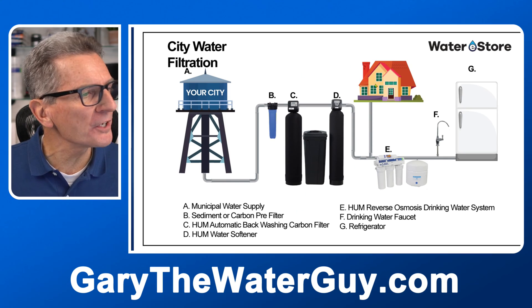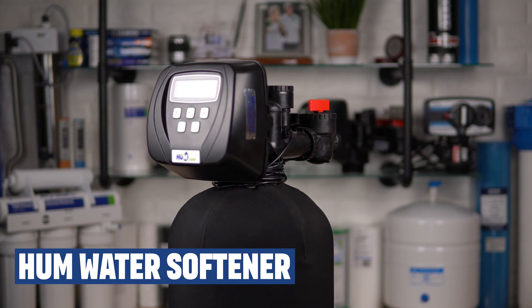And if your water's hard, a water softener is the next in line. These use water softener salt to clean out the resin beads inside the media tank. You'll need to top up the salt based on your family's water usage. A water softener will make your water much more skin and hair friendly. You'll save money by using less soap and making your home — and especially those shower doors — much easier to keep clean.